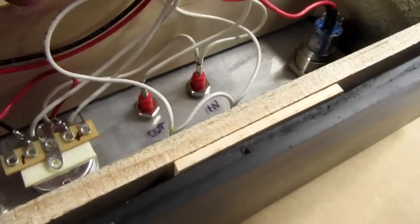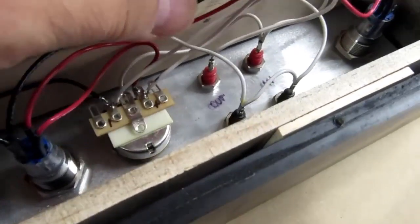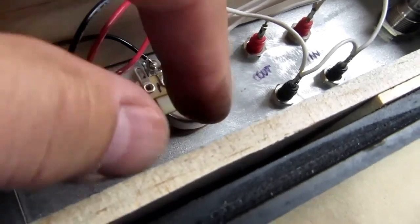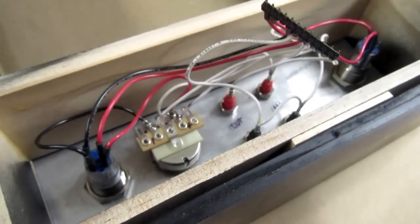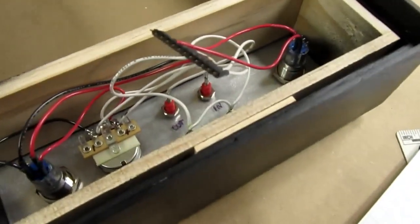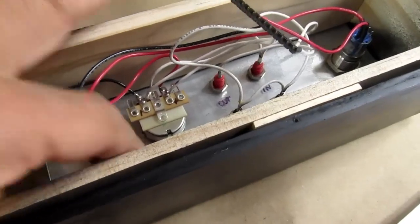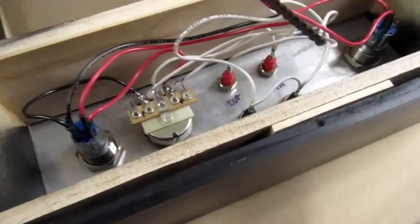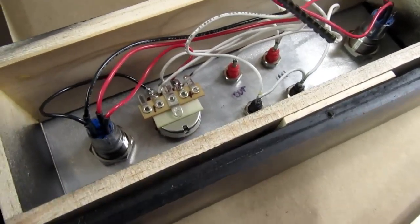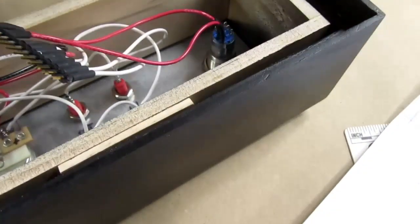And then the other wires around here, I want to put the auxiliary board probably down around here somewhere, and then all these white wires coming off the pot and so on have enough length to reach over to that auxiliary board. So I think that'll be pretty good, actually. It should work out pretty well. I just need to now sit down and figure out exactly where I want to mount these meters in there, and then hopefully I saved the file for the front panel express graphics. I usually do save those things, and it's probably on my computer. In that case, I can just make a copy of that for this version and remove the pin jacks and put in the two meters side by side with appropriate graphics over them.